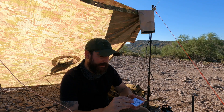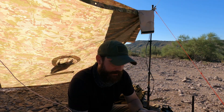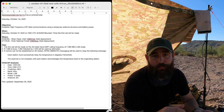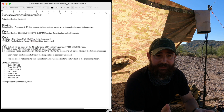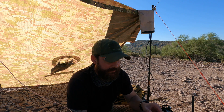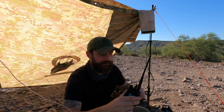It has worked for me in the past. The way we came up with our commo plan was to establish three HF frequencies. Our primary is 7.285 MHz, our alternate is 7.265, and our contingency is 7.245. If we get on the air and anybody is on that frequency, we'll just move down to the next one. If all three fail, we're going to try VHF and something called APRS. I'm skeptical whether that's going to work, mostly because I am very far from the nearest station — it's over 45 miles and I just have this little HT.